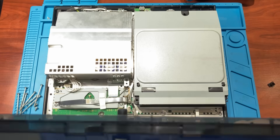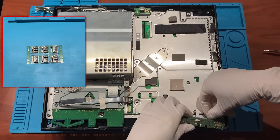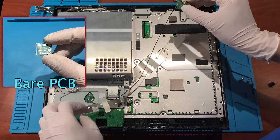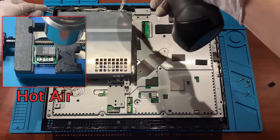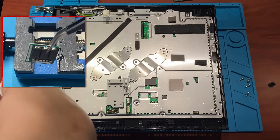As we tear down the console, I really hope we get yellow light of death 102 because we can fix 102 using this Felix tantalizer. Where did I get the Felix tantalizer? By doing SMD soldering, wetting the PCB, putting the components, blowing hot air. We have one tasty Felix tantalizer ready.